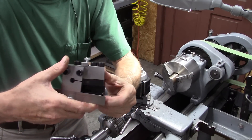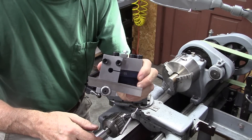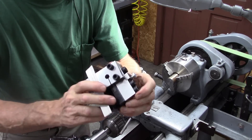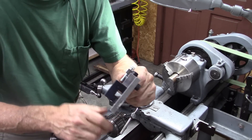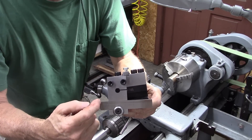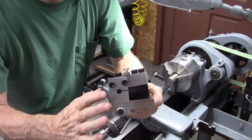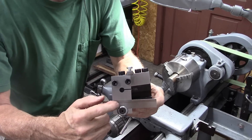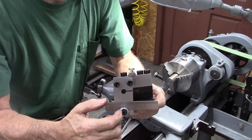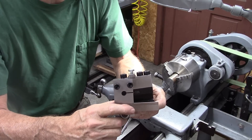This is my quick change tool post design — this one's an AXA. I got plans and I'll post a link down below for the BXA and AXA for making this. Fairly simple project, works outstanding. But here's what I found: this stick out right here needs to be about three-quarter inches or greater. I know that's counterintuitive — usually you want it as close to the tool post as you can go, but it affects the strength of this spring and how reactive the tool is. It works best at three-quarter inch or more if you've got larger stock to cut.